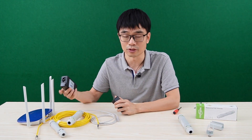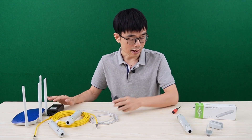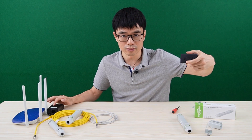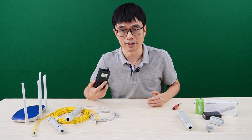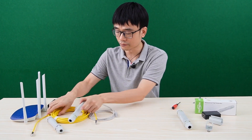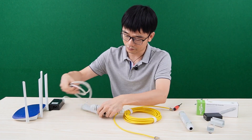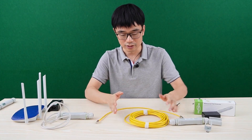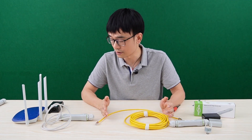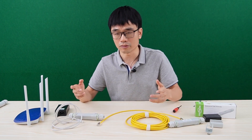You need to place the PoE injector next to the first router. At the end, you also need to use a PoE splitter. It's easy to understand why we need the PoE injector — because we need to inject the power. Two cables connect together with a maximum distance of about 1,000 feet, and we need the PoE injector to send power to the two extenders. Otherwise, they will not work and there's no way for them to get power from an external power supply.